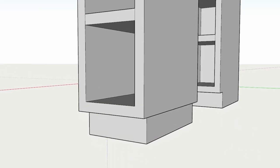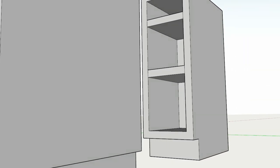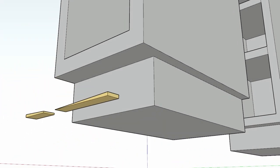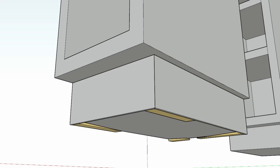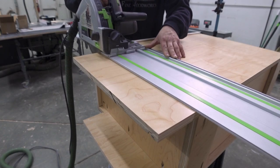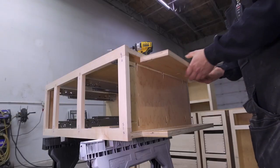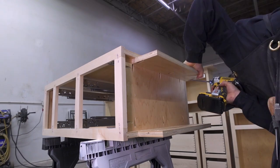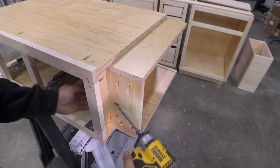Remember the toe kick I mentioned earlier? Having it wrap around the side versus a continuous side gives us the ability to level the cabinet with shims, then hide the shims all of the way around with quarter-inch toe kick paneling. We disregarded that design change when we were fabricating the boxes because I knew it would be easy for me to make the customization later. And of course, later is now, and so it's easy enough to remount the recessed toe kick.